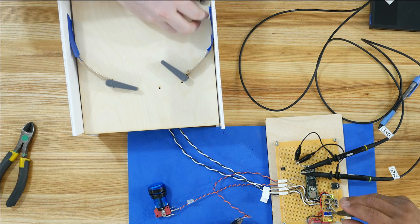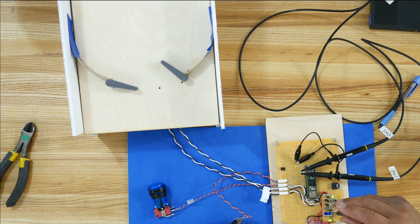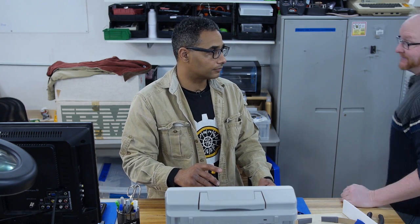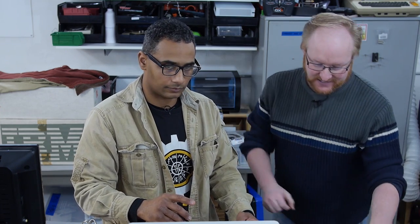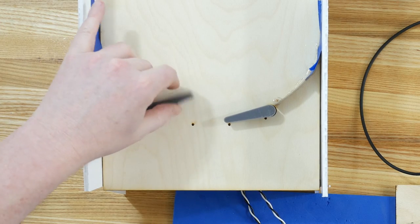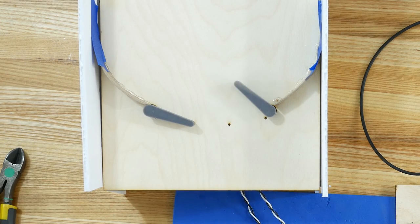See, all it has to do here is prevent the ball from pushing it back down. Okay, release it. So we do a tenth of a second. It probably wouldn't even take that. I mean, you could probably do like 5 milliseconds of full force. Or we could just do a high PWM and then switch the PWM. So we could just do a software timer.